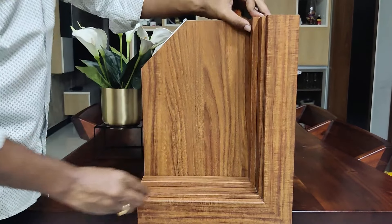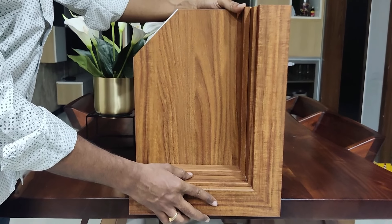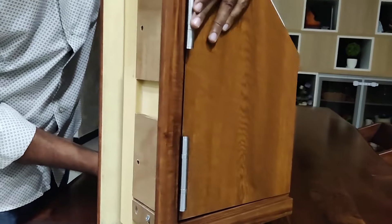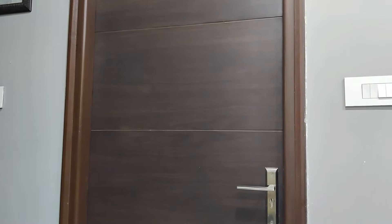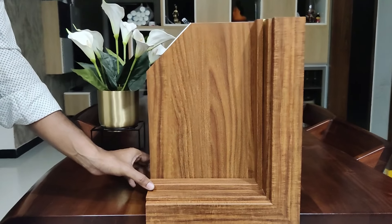Then come the two key components that add beauty to the door: the front architrave and the back architrave. The front architrave is 60mm in width, and the back side is a flat 30mm architrave. If you see traditional doors, a lot of times only a small architrave is provided on the front side. On the back side, they just leave the frame as is without an architrave — and as you can see, it doesn't look good with adjacent wall distortions being visible. In our door, all those gaps are nicely concealed under these beautiful architraves.